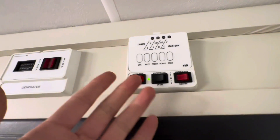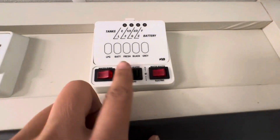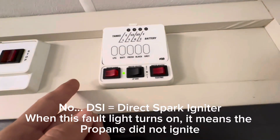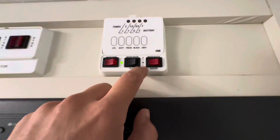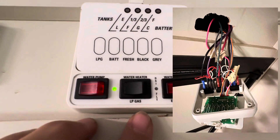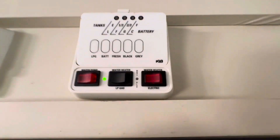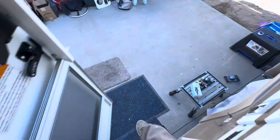What is going on? I'm checking to see — oh my gosh, it's getting hot. So it wouldn't turn on. Over here in my control panel I had a DSI error, which has been there forever. That just means that the propane tried to ignite but it didn't. Now I know these switches: flip to the left means it's on, flip to the right means it's off. The DSI light was also messed up, so I actually had to take this whole panel out, fix the light bulb inside. Now the light is proper, but I don't have lights for these two, which is really confusing. But I got my propane working.